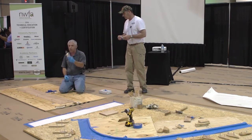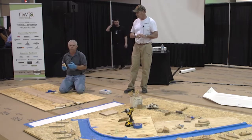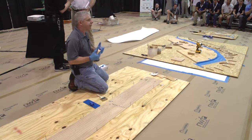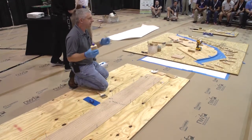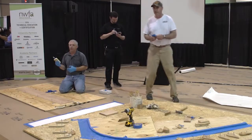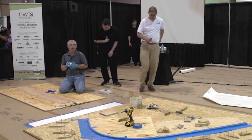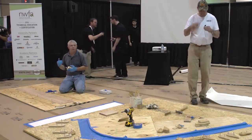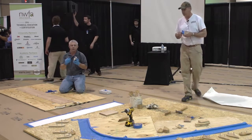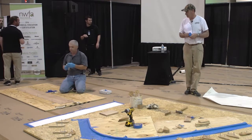Sprig likes to use regular carpenter's glue. Me, personally, I typically use something more like the urethane glues, the gorilla glues. It tends to have a little bit more open time — most of the time I'm doing it by myself and I need that extra open time. It doesn't really matter what glue you're using. A lot of times we'll try to match the color of the glue towards the wood. If you're doing darker species — Brazilian cherry, walnuts — some of these glues come in brown colors. You want to go towards those brown colors so you don't see that little faint line. That helps a lot.